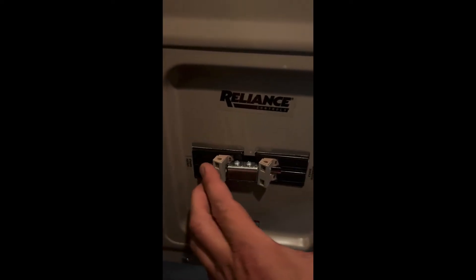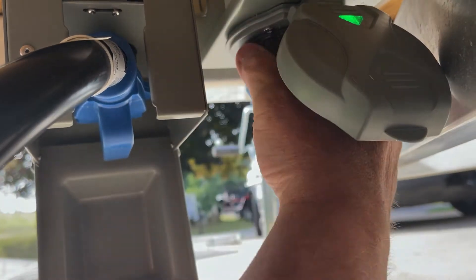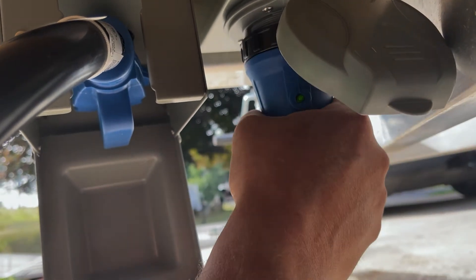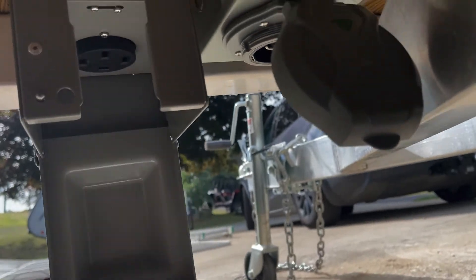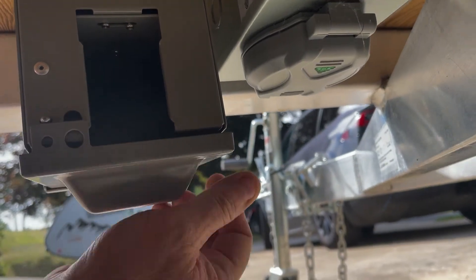The next thing to do was to transfer the power from the solar to utility. That's the sub feed that the solar trailer runs when it's parked in the drive. Now that I've transferred it, I can safely remove these plugs — although the hot ends are always female so there's no danger either way — and there's no interruption of service.